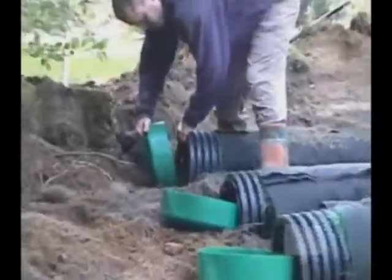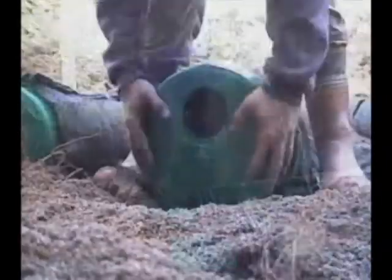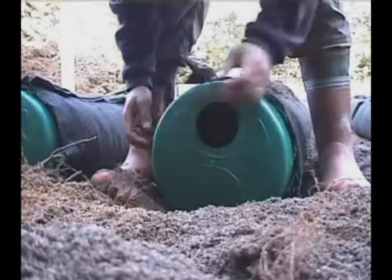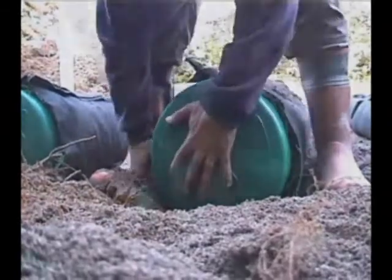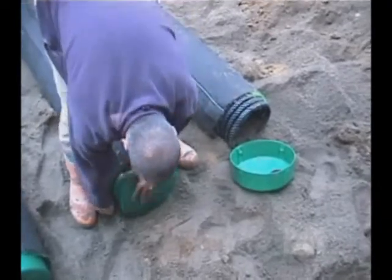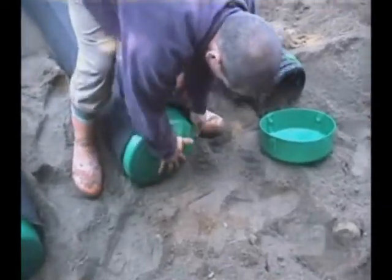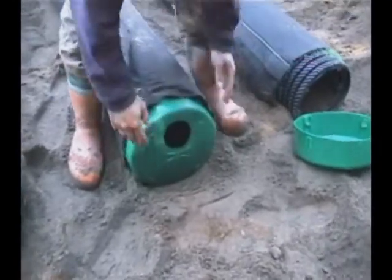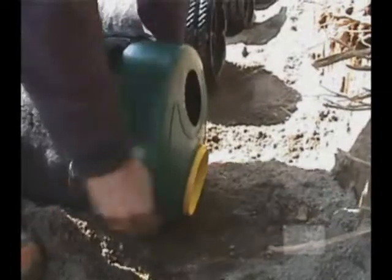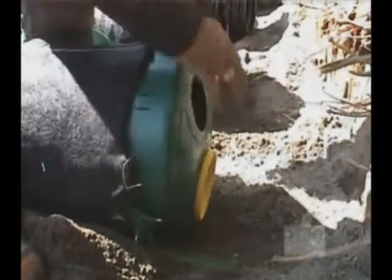Place the 1-hole off-centered adapter at the end of the row of the water supply side, or uphill side. Then pull up the geotextile membrane to cover up. At the other end of the row or downhill side, where the piezometers will be installed, place the 2-hole adapters. They must be placed vertically. Once again, cover the ends with the geotextile membrane.